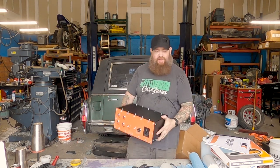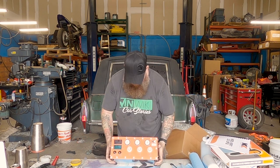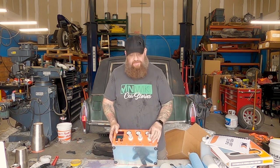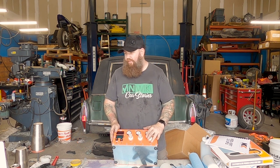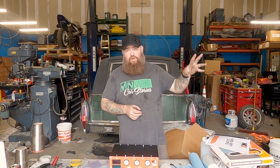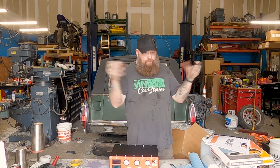That thing is a unit — sturdy. It's powder coated, and apparently they make these in Tennessee — they actually build them there. This one does not have what they call DPW, the digital pulse wave. Because when you get into tight areas, you'll create a Faraday effect — you get these eddy waves of magnetic interference, and powder won't stick in those. The way powder coating basically works is you're taking powder, positively charging it, and negatively grounding the part. Once you spray those positively charged particles at something that is the negative to complete the circuit, it just sticks to it.